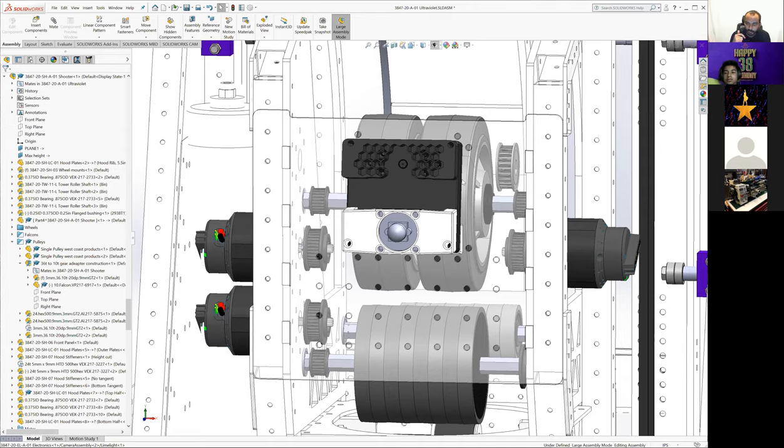So as the balls are pulling through, the wheel's trying to spin at, let's call it 4,500 RPM. When the ball comes through and starts slowing down the wheel as it adds resistance, the motors can generate as much power as they need to hit that 4,500 RPM mark, right? If we tried to shoot at 9,000 and we're completely saturated, as soon as a ball comes in, there's no way the motor can add any more power to get it to stay at 9,000, right? It's already running at full voltage.